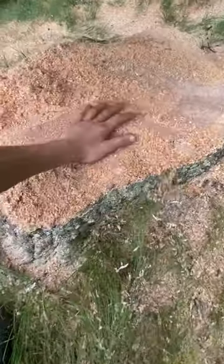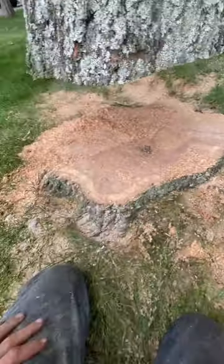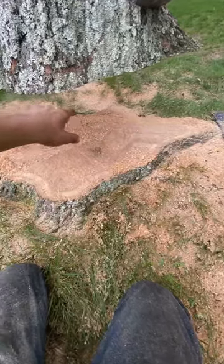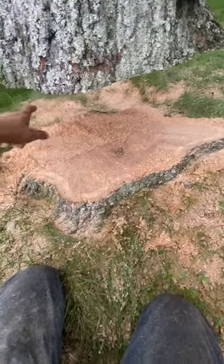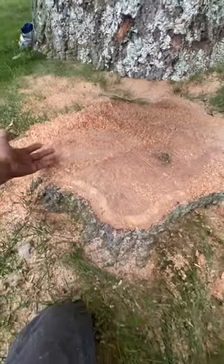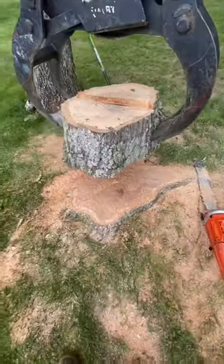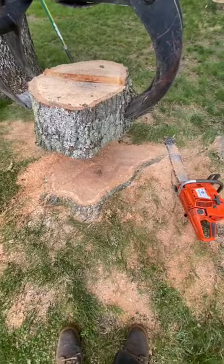This one walked on me a little bit — it ain't perfect, but I'm just getting ground down anyway. Use the top of the bar, bore in, and work your way right around in a circle. If it's sharp, it should line up almost perfect. You can see it was a little bit off but not much. Good trick I learned — or taught myself, can't remember.